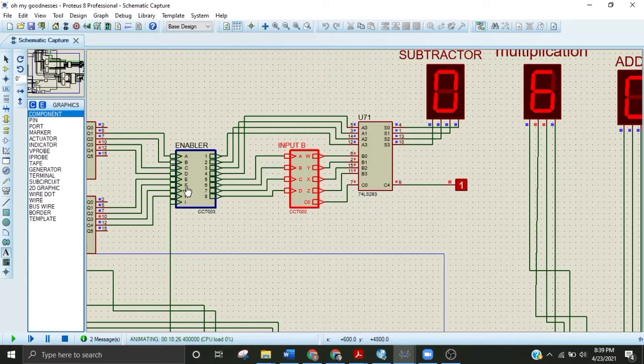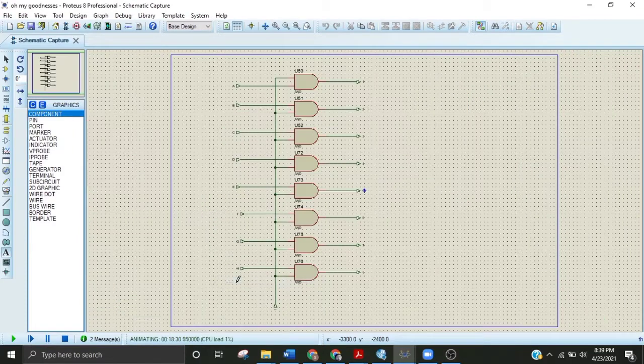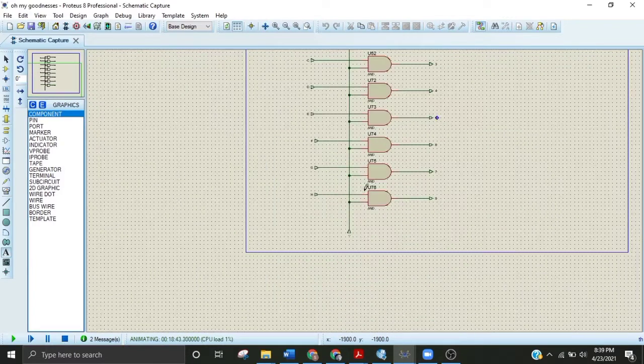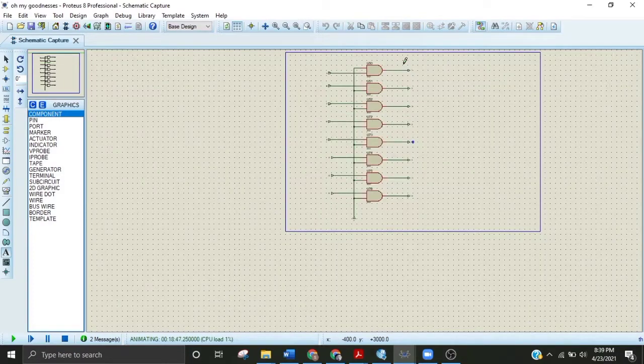The A section of this IC is directly connected with the enabler. The enabler is generally a combination of AND gates. An AND gate is basically a multiplier — if I multiply one with zero the result is zero, and with one it is one. It will output one only when both terminals are at logic one state.